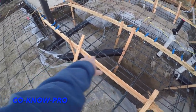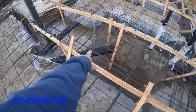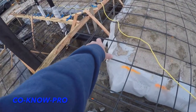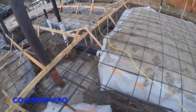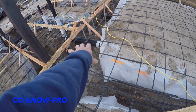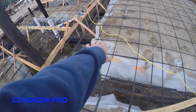We got our sleeves — all our pipes that run across the footing have a sleeve, and it's wrapped on the inside of that sleeve. You can see the sleeve going through there with the wrap coming out. That way, if there's any flex in the foundation or the footing, it'll take it on that sleeve, and any pressure will be transferred through that foam before it hits the actual sewage pipe.